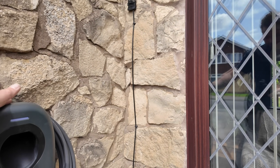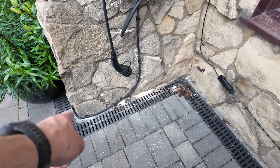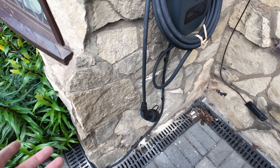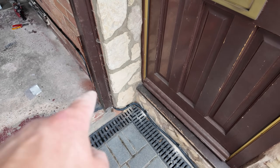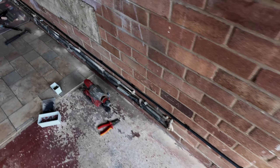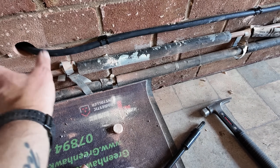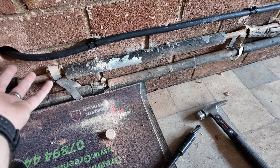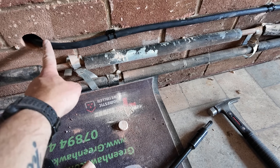So we've now got all the cable in — back into the cupboard underneath the stairs. The EV charger is mounted up on the wall and we've come down and tucked it round. I needed to do a bit of hoovering. With the core drill done that way it takes all the pressure off the edge of the cable, and then we'll silicone all this up to make sure it's nice and neat and sealed. Even though it's an integral garage, it's always best to seal these up.